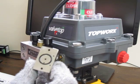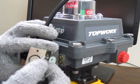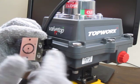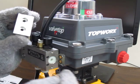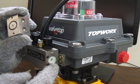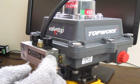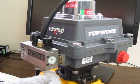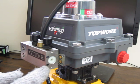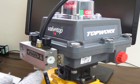Now, if you'll notice, we have an O-ring here for a secondary seal, as well as two O-rings inside on the center block of the spool valve. These O-rings here should stay in place. Before you put the new manual override on, ensure that they're there.